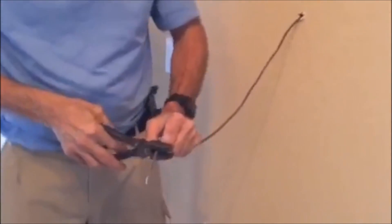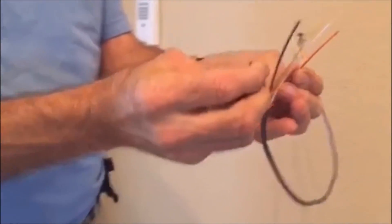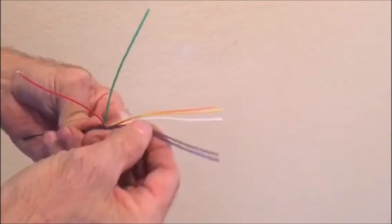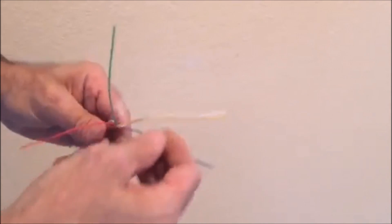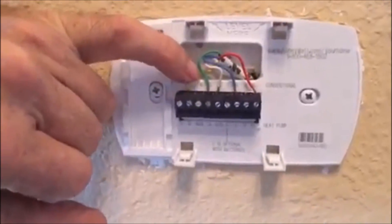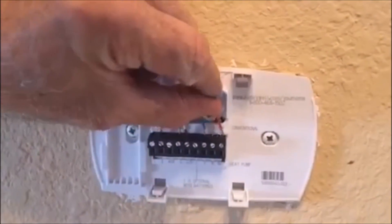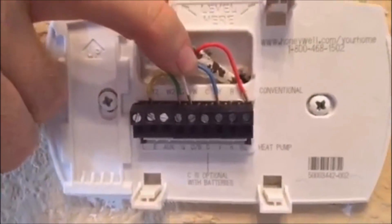Now I'm going to strip the new wire back. You can see he's now got all the wires he needs for his new Honeywell Wi-Fi thermostat. We don't need the black wire for now. The blue wire will be the common. We won't need the green or orange ones. Here's the existing thermostat — it's an old one. He's got Y2, green, W for heat, Y1, R, and RC — see how they're interconnected. What he's missing is the common wire, and that's the whole reason we're here.